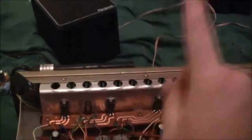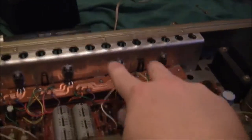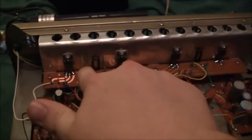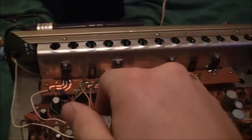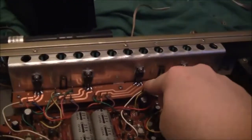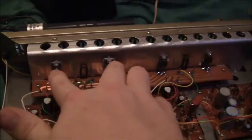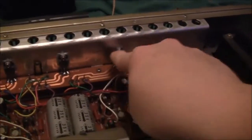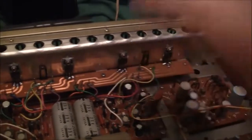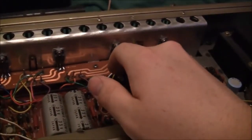The reason in the last video the bad transistor was still there: I accidentally replaced the transistors on the wrong channel. Looking back at the video as reference, I realized I'd talked about this transistor but the bad one was still in there. So I took the two good transistors from last time and put them on the correct channel, and one of those ended up being flaky again. I think there might be something wrong in the circuit that keeps taking these transistors out — it could be another issue — but right now it seems to be working fine.